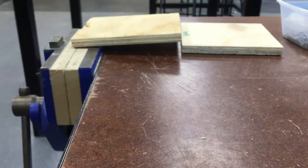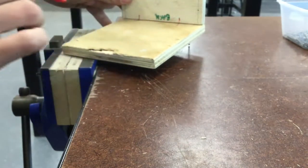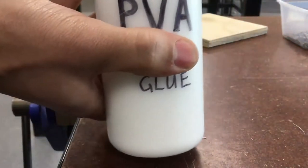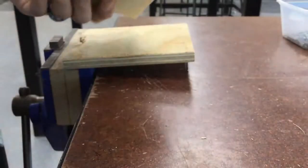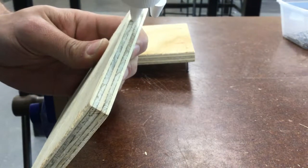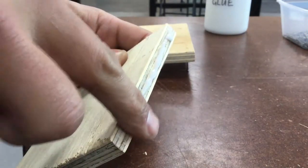For my piece, this is the best edge — I'll do a couple of red lines to show me where it goes. Now we could nail it together but it won't be particularly strong. The nails hold it, but the glue binds it permanently. So on each of the two edges we're joining — including this bottom here — we need to add some glue. We don't need to go crazy.